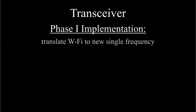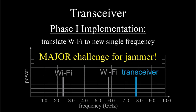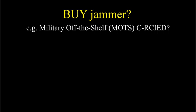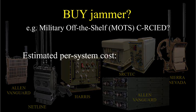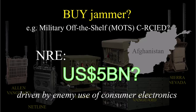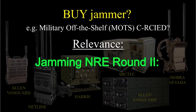In phase one of the project, the WiFi link is translated to a single frequency outside the WiFi bands. This is a big change for the jammer because it doesn't know what frequency the transceiver is operating at. It is in no way practical to design a system from the ground up that can hunt for, find, and identify the link frequency in a signal environment cluttered by civilian infrastructure. Could the enemy buy a jammer to do this? A counter-IED reactive jammer could in principle do this. These jammers are available from several suppliers; the per-system cost is estimated at $50,000 to $100,000 or possibly considerably higher. The technology development cost is in the billions of dollars — driven by the enemy's use of cheap improvised explosive devices costing perhaps tens of dollars. This matters because the jammer-hardened transceiver may trigger a similarly asymmetric cost.